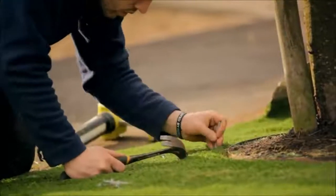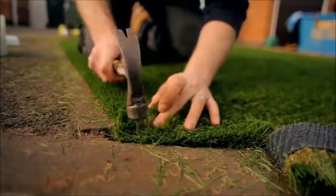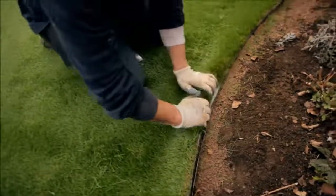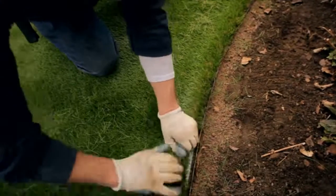Open the pile up to ensure the nails do not bury any tufts. Trim perimeter edges and nail at corners approximately every 75cm. Where the pile runs away from the perimeter edges, kink the carpet and brush the pile with your hand to encourage the pile to run into the edge.